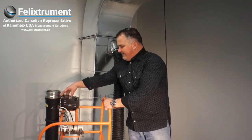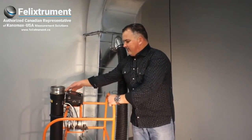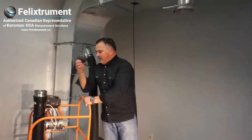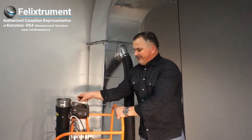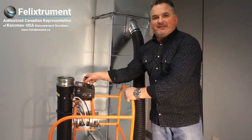We're going to do a negative test — same 6 seconds. We've begun the test. Our limit of leakage is 6 and we're only leaking 1. We just got a pass. We're going to press save because my engineer wants that data.